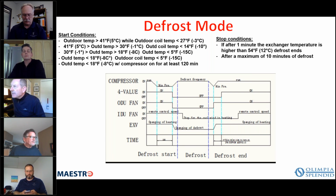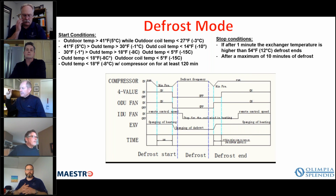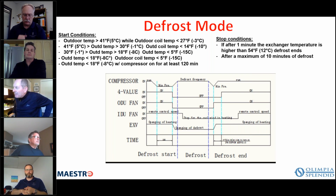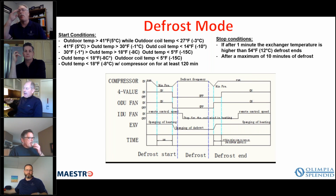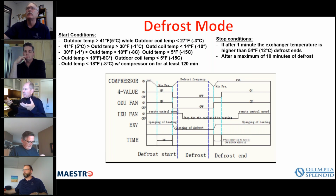Okay. Hey Murray, can you mount these over a baseboard heater? Well, it's a plastic cabinet. I'm not sure. You need 4 inches of clearance minimum from whatever's below the unit, so you can get the condensate out if you need to. Right. You have to raise it up higher above the baseboard. I guess I'd be a bit leery of having a warm baseboard right below the unit.